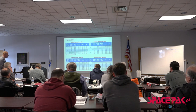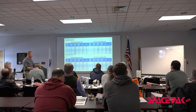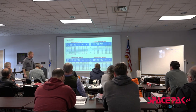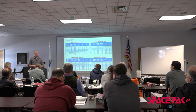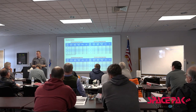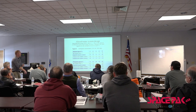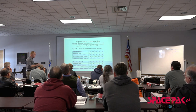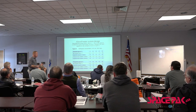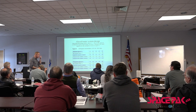Flexibility, capacities. When you look at our COPs, right over here, we're at a 3 COP. We don't really ever drop below about a 1.6. So for argument's sake, with electric being that bad four-letter word, we're making money on our investment, dollar to dollar as far as energy cost. We want about 30% glycol mixture in these systems, in that loop that runs throughout the system. No more than 30. 30 usually gets you down to about negative 20 plus or so. There is frost protection built into our equipment based on temperatures.